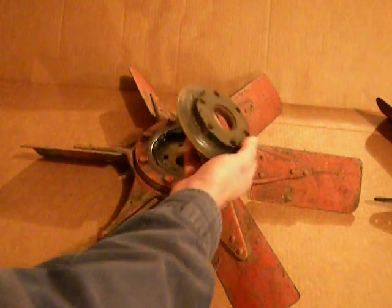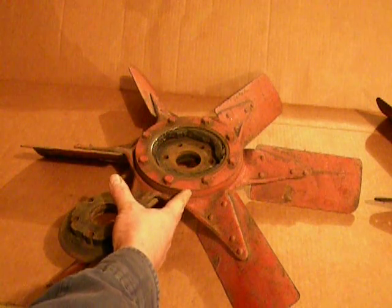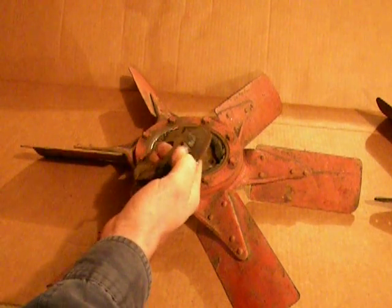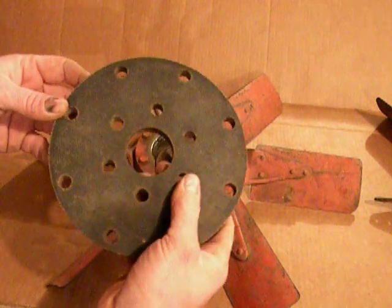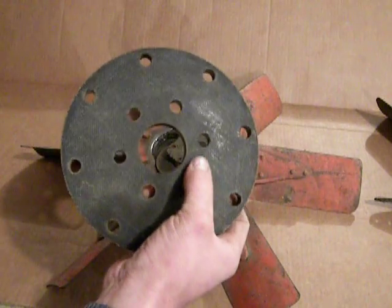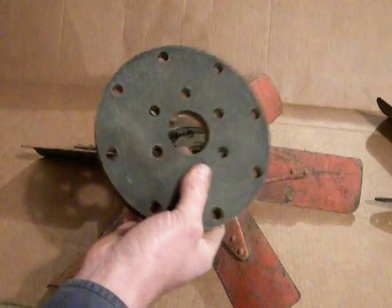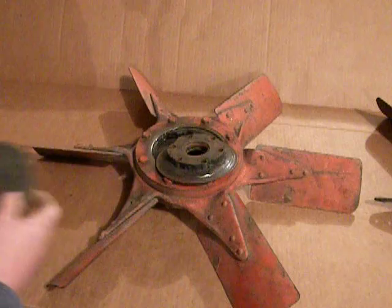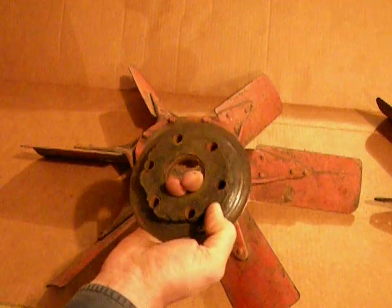But you can see on this one, this piece can be pulled right out. So this fan actually has solid rubber disc couplings in it — flexible discs. This is the first time that I personally have seen all rubber flexible discs. Usually it's what I call a belted style disc, which is what this is. The reason I call this a belted style disc is because it's made of a material that resembles belting. You can see there's a heavy fabric weave in there with hard rubber laminated between the layers. This is what's in the parts books for the entire 2H series RD6 and D6 production run. I don't know if these rubber ones are an updated style, a later replacing design, or if they're an aftermarket piece or what.